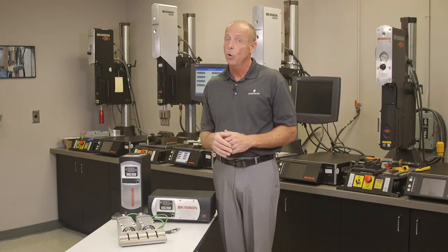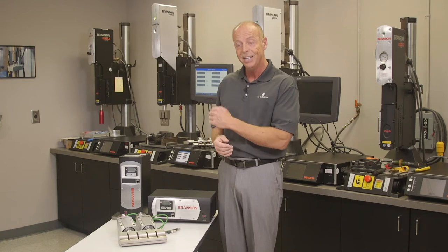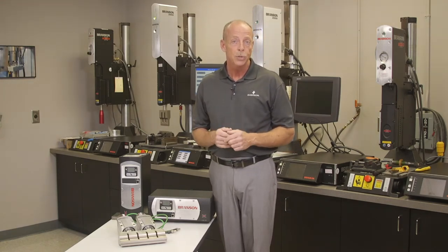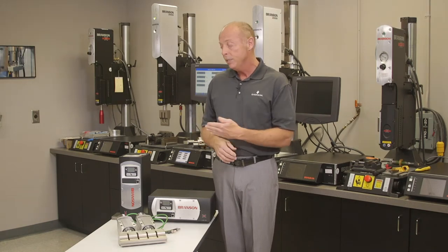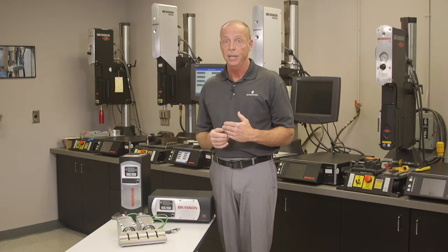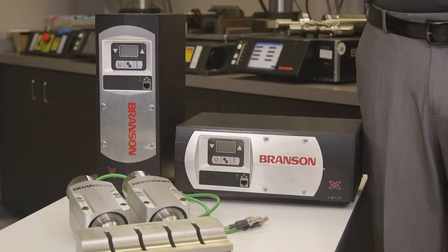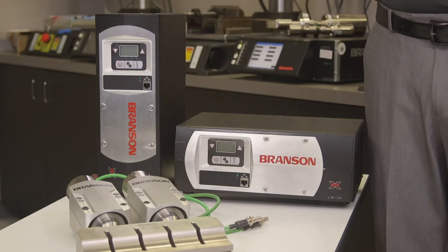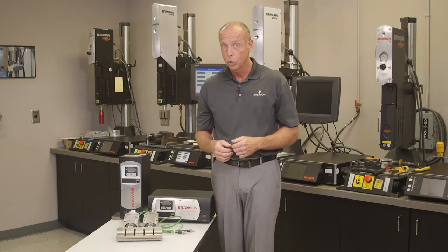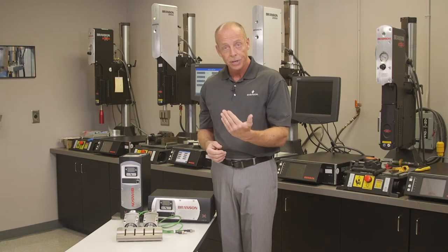So we have controlling parameters that we establish, especially based from our initial testing, that we don't want to violate in any cycle. And if we don't reach those controlled parameters, these machines will generate a latchable alarm. So this prevents quality trouble getting into and through production. In automation, the tooling can also look very different, where the machine builder will determine what is the ideal actuation method. Could be pneumatic or even servo controlled. Our tooling offering looks very different at that point.